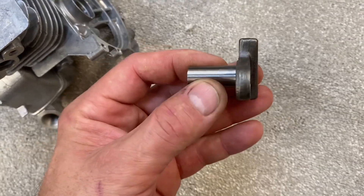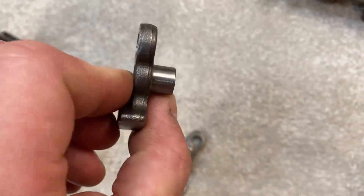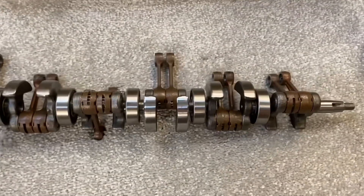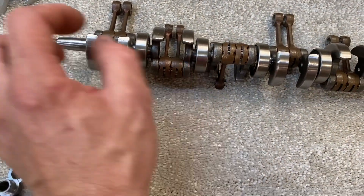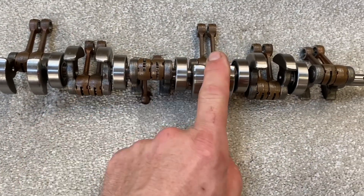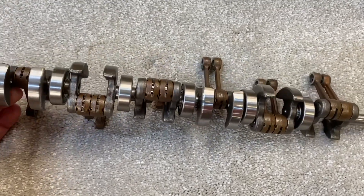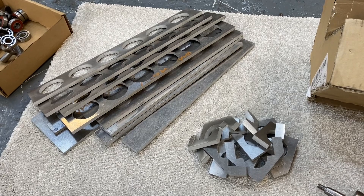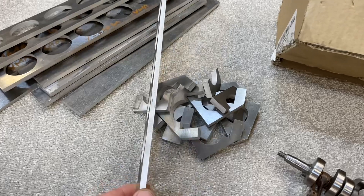I machined them so that they were like this, so they fitted together a bit like Lego really. Then I made this crankshaft using longer gudgeon pins, the original main bearing bearings, original con-rods and bearings. The block - which is not really a block at all - it's laser cut eight millimeter alloy sheet.